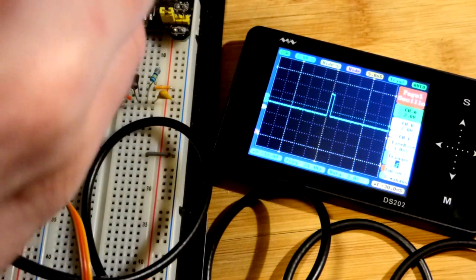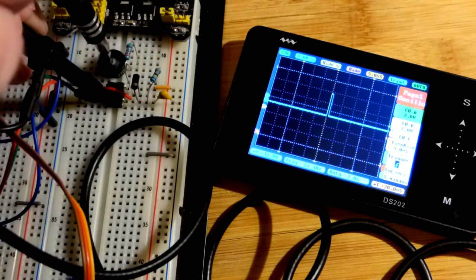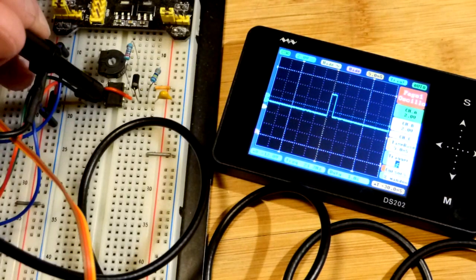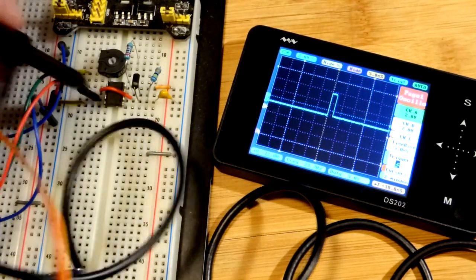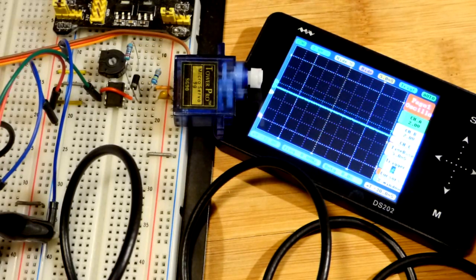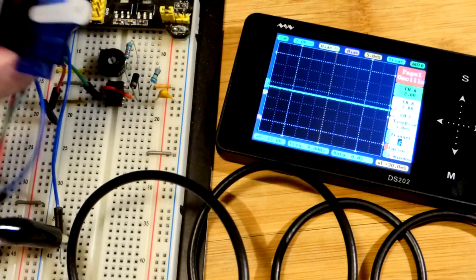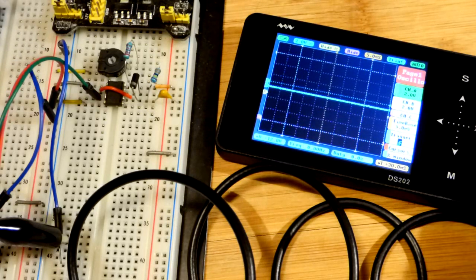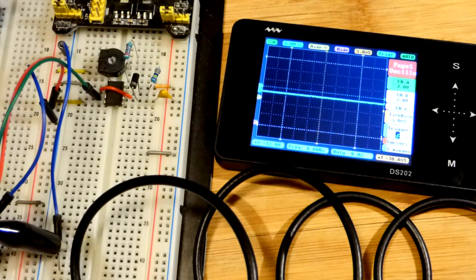It's actually a series of pulses, but zooming in you can see the pulse getting wider and narrower as the servo moves. The main takeaway is that pulse width - how long we give a high signal - determines the position of the servo. I'm new to servos and this particular one may not behave exactly as expected, but we got it to work. Hopefully I can make better servo and 555 timer videos - thanks for watching.